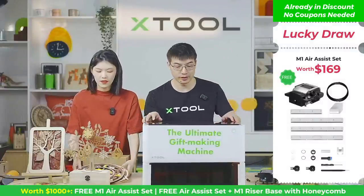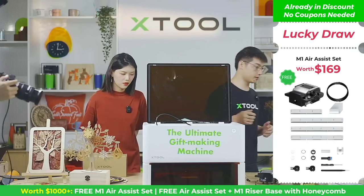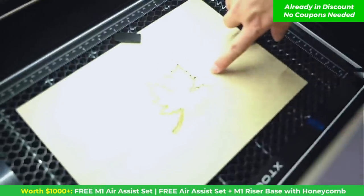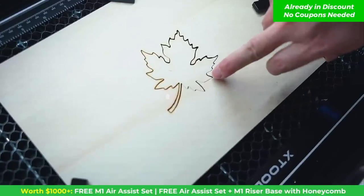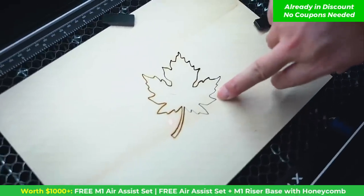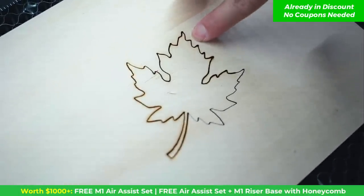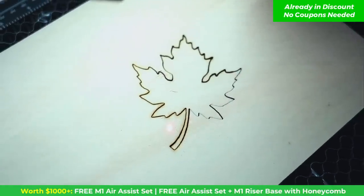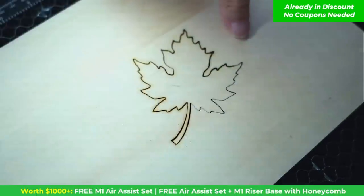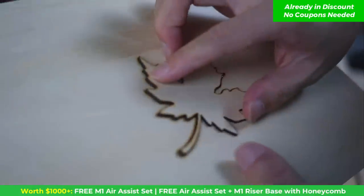We finish. Okay, here we can see the difference with and without the air assist. I think you can see it easily from the camera. Here is with the air assist, so the cutting edge is very clean and the line is very sharp. But without air assist, the cutting line is not that clean and not sharp. So we can see the difference here. It's easy to see the difference. You can see if I put it back.